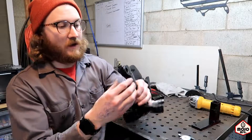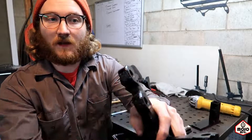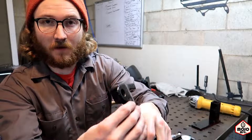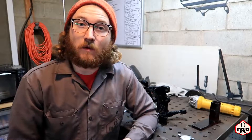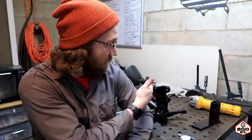This point where the strut mounts — for some reason this is like a quarter inch smaller than the 4 cylinders, so we have to make a little spacer there. I have some quarter inch stock and I'm just going to cut out a small little spacer for that.